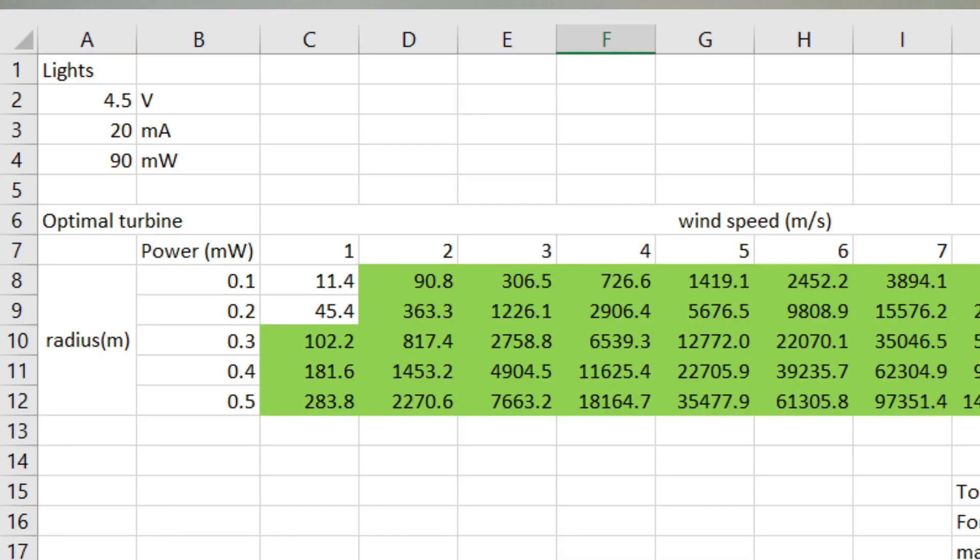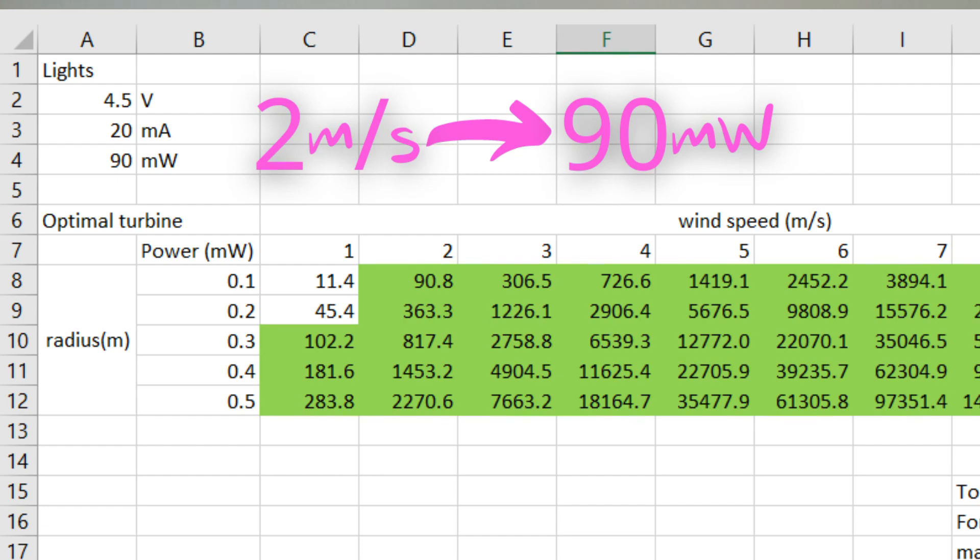The first thing I'm going to do is break down the project into components and assess where the most risky aspects are going to be, so I can test those ones first. I'm a bit worried about the aerodynamics. I did some preliminary calculations and it actually looks fine — even with a 100mm radius rotor, there is in theory way more than enough power available even at really low wind speeds. But these calculations are based on maximum theoretical efficiency, and my gingerbread blades probably won't come close to that. I also think the blade structure will be a challenge, especially where they attach to the hub — so the shorter I can make the blades, the easier that challenge will be.